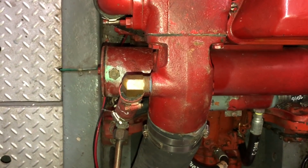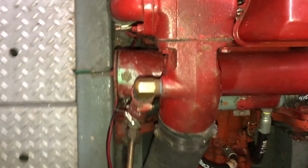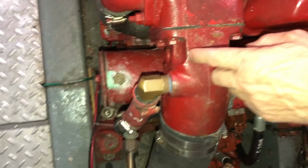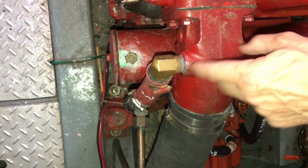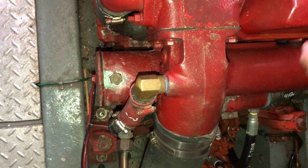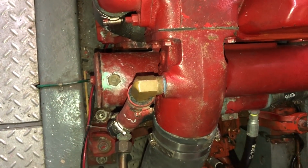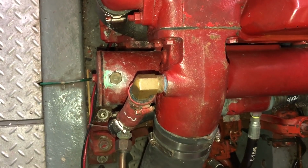The elbow was replaced in, I believe it was the fourth quarter of 2013. This is due for replacement again. They have a tendency to corrode on the inside bottom from the mixture of corrosive salt water and hot exhaust gas. I've never had one fail, but from what I understand, when they go, you start to get exhaust gas exiting along with salt water into your engine room.